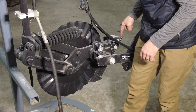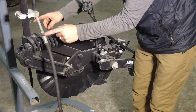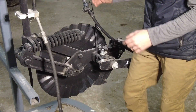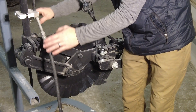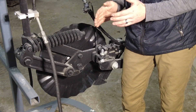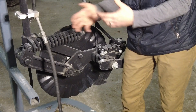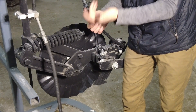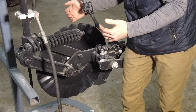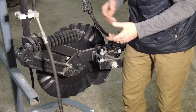Today you have a single orifice that goes back to your knife, but with the triple threat you'll have three orifices — one on each side of the split, and then you'll still have one going back to your knife. What I love about this system is you can control how many gallons you're putting at the base of the plant and how many gallons you're putting in the center of the row. This can come in handy because year after year we may need nitrogen in different places at different times. If you've had a lot of rain and your two-by-two fertilizer has maybe gone away and your corn is showing some stress, we can throw another shot in the arm to that crop using the triple threat fertilizer system.